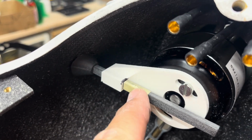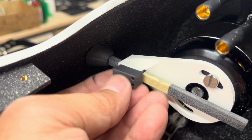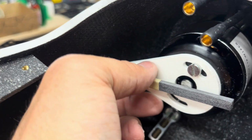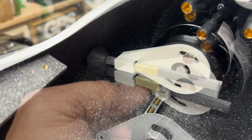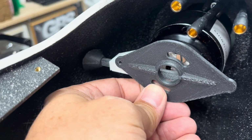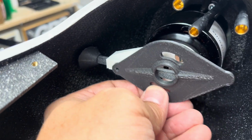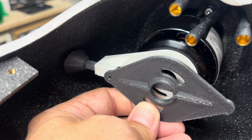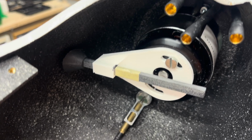Then I just have to get the end of this minus 4 millimeters, and I will glue this top on the bar, and it will be perfect when I mount the engine support with the other magnet. To make it very clear, this is the part that will be mounted on the engine. As well, there is a little bit of play to adjust exactly where the prop will be mounted, and the magnet should fall right in front of the other one, and it's quite easy to mount and dismount the engine as well. It's quite an easy system.